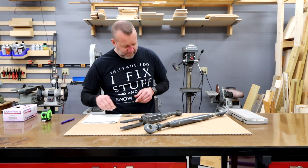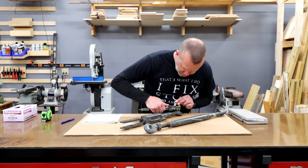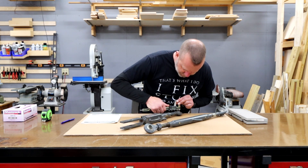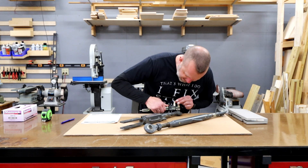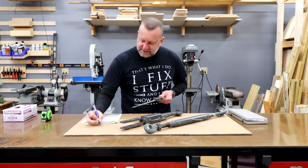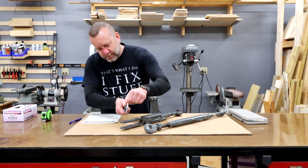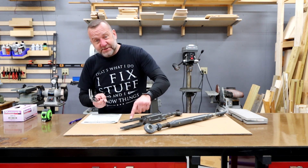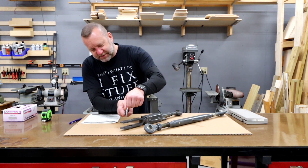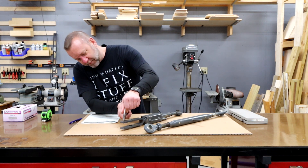Side link — top is 0.758, so once again, three-quarter inch hole. I usually use this hole, but I'm going to go ahead and measure this one just because it's less likely to be rounded out from use.